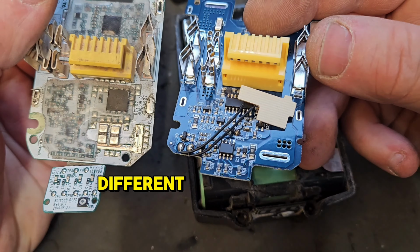This is what's called a DC power supply or bench power supply. It plugs into your ordinary electricity, and it puts DC voltage out the leads, so you can charge things like this battery. And that's what we're going to do. We're going to bring up the voltage of the battery with this. We're hooking this up to the power supply, and we'll set it for 19 volts, and we're going to just push the button and let her start charging, and we're going to come back to her later when she's suitably recovered.